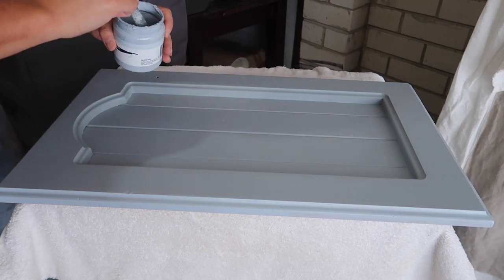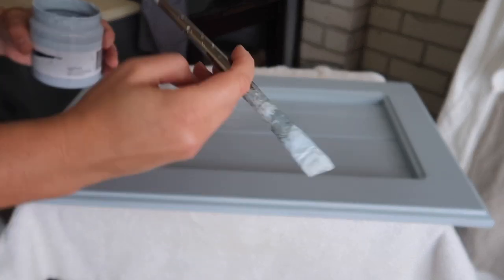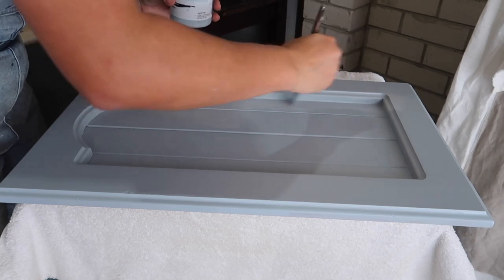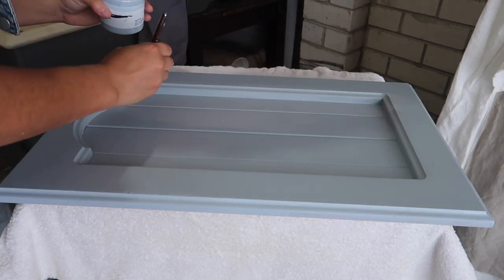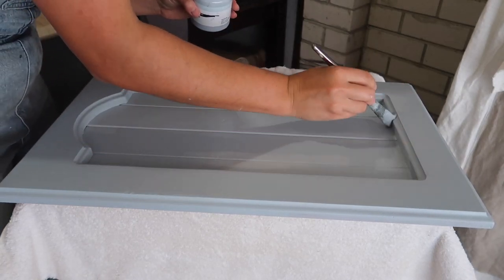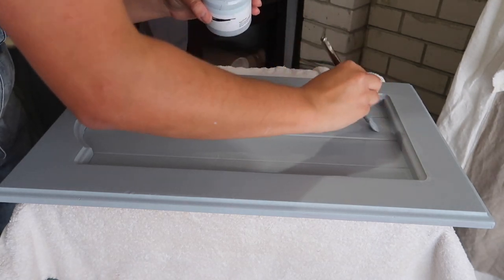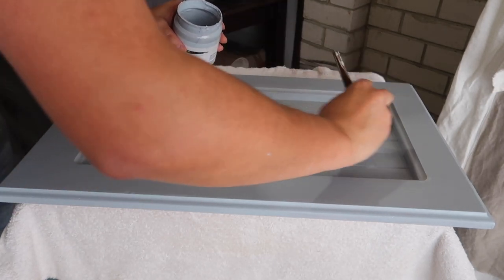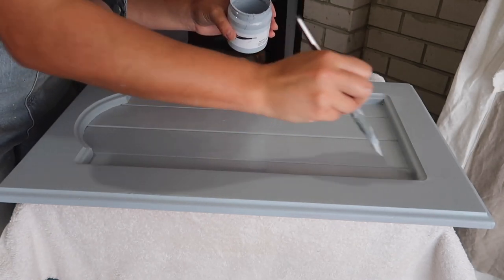It has a lot more coverage, and because this is a lighter colour, three coats is ideal. I've switched from the large chalk brush to a smaller artist brush for two reasons: I can conserve a bit more paint and I have a lot more control, getting more coverage on the actual painted surface. As it has panelling, it helps get into all those grooves and the detailing on the side. If you've got a smaller amount of paint left over, it's a good way of conserving what you have rather than loading a bigger brush and getting more streaks.